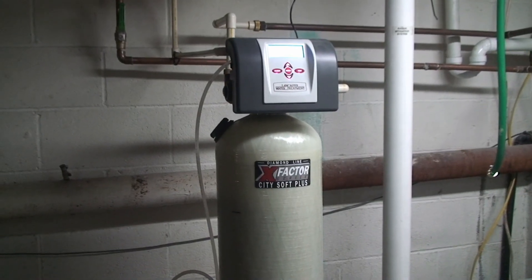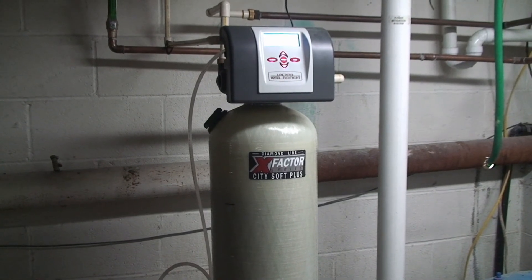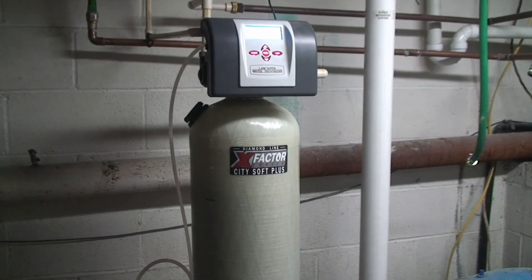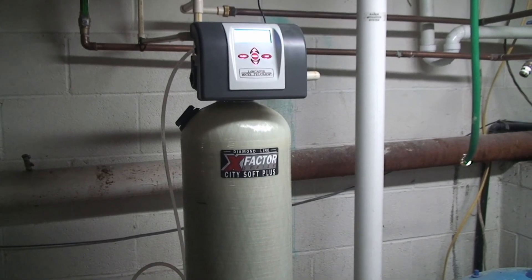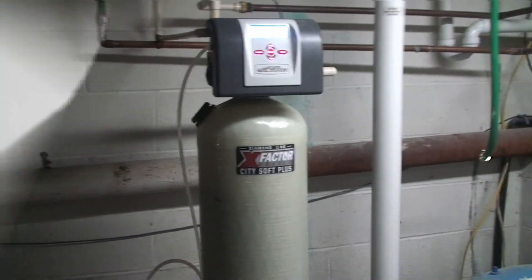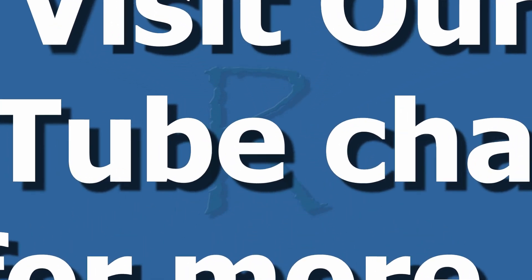The level of my tank, when measured from the top of the tank, was probably down somewhere to 25 to 30 inches from the top. Now it's at 10 inches — so that's 15 to 20 inches of calcite that I put in. That was a 50-pound bag, and that's how they normally sell it. Based on that, you can judge how much it takes to fill.